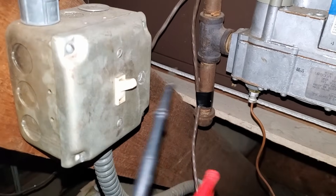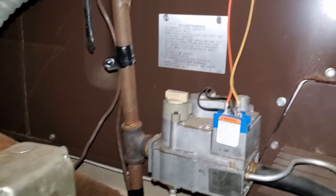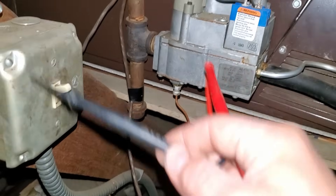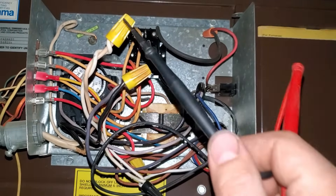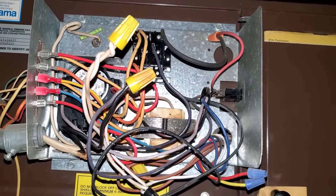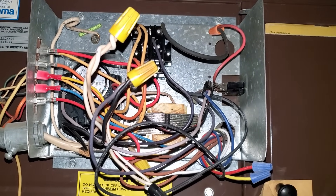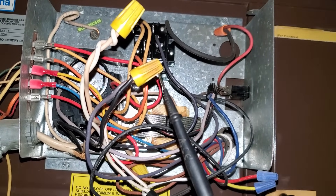Right now the power is turned on. Typically there will be a switch adjacent to your equipment. This equipment is pretty old — you're not going to see this exact setup — but the concept still applies. We follow our main power wires coming in here, and you can see that they're spliced right here. These are the field installation connections. The rest of the connections inside most furnaces are done at the factory, so these ones are oftentimes the most suspect for having issues.